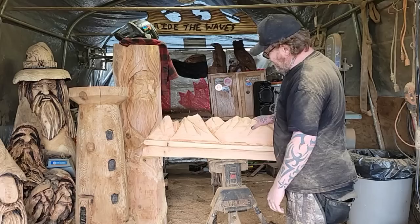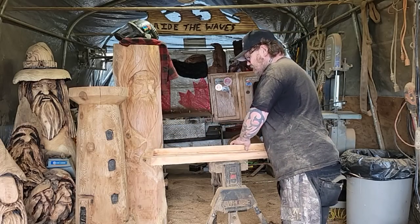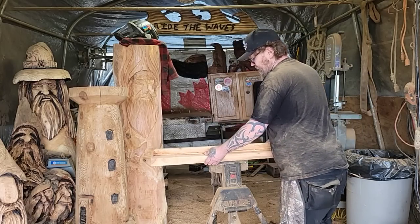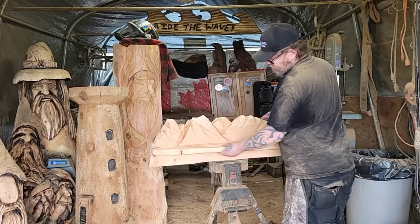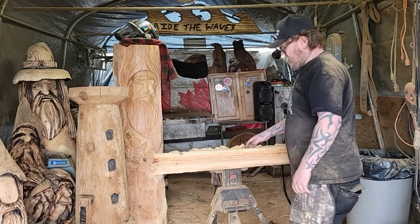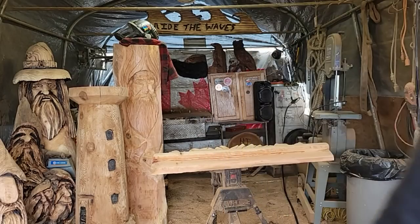I don't really care. So I think what I'll do now is I might as well burn it. I'm going to burn under here, and then I'll burn here. I'll try and leave this raw looking, natural, but I'll burn up here and stuff. With this wide grain cedar, the softer the wood, the more you burn away your details. So you have to remember that.